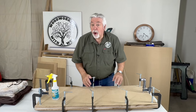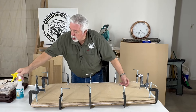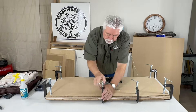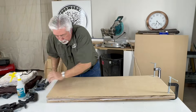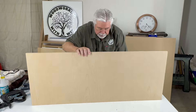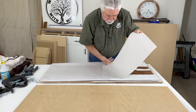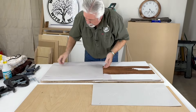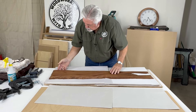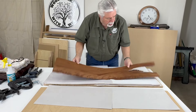Well Nathan, it's been overnight. We changed our papers three times yesterday, just like our instructions on the bottle told us to do. Let's open up and see how we did. Here's the unveiling. Our paper is dry, which means it has absorbed all the moisture from our veneer. Here's our first piece — look how nice and flat, and how pliable this is. It's not brittle anymore.